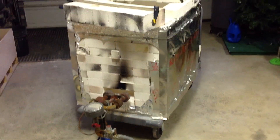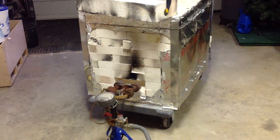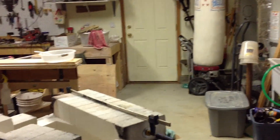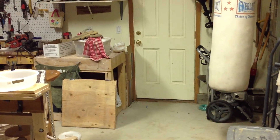I wanted to go over my little kiln and some features of it. It's a small natural gas fired IFB kiln, an updraft that I made using what I had on hand. I did have to buy a rolling cart, so the kiln is built on top of this rolling cart and I can wheel it out of my door in the back into the backyard where I have a gas line.